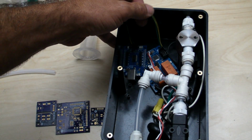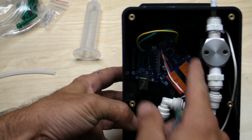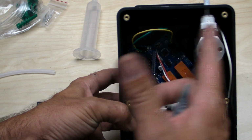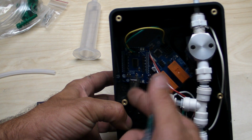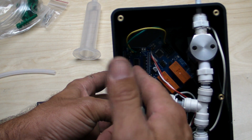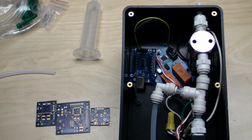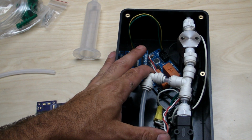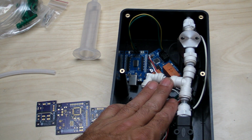But basically, I have an older relay board that I designed a while ago that's basically just an Arduino that drives 2 relays, and then it has some hookups on it so that you can hook like an XBee or something up to it. Right now I just have a USB to serial board powering it for simplicity's sake. And basically I just have some code that reads a button, and then it opens up the relays depending on the state of that button, and it couldn't be really any simpler than that.